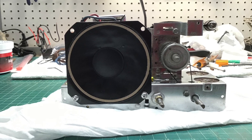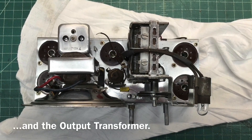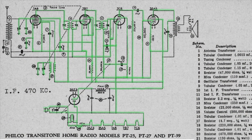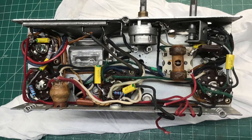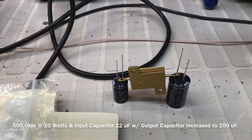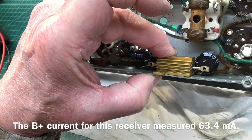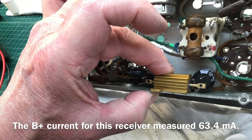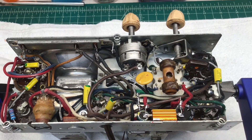I've got the loudspeaker back in place and mounted, and the rewiring and component placement is almost 100% complete at this point. Just wrapping up with the B-plus itself, getting the resistor mounted — it takes the place of the field coil and the capacitors. Still need to tidy this up. Let's go ahead and power up the receiver now and get into the troubleshooting issues I mentioned earlier.